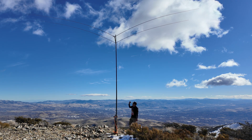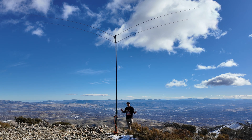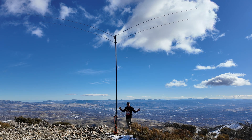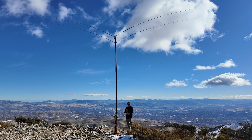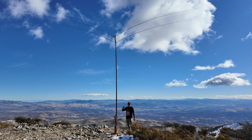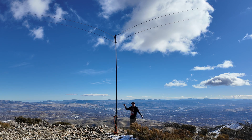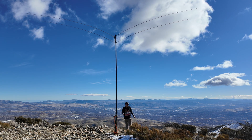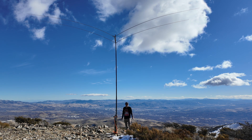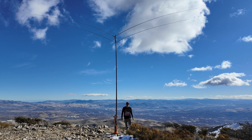What I'm doing is tuning the back reflector element, and then the director element is four percent shorter. I've taken Sharpie markers of different colors — this took me a long time this morning. I got my base measurement for each element, subtracted four percent on the director, marked it with a Sharpie, and drew which band. So when I go out I can just go to the marks, fine-tune with my nano VNA, and when I get it really dialed in I make another mark. That way I don't have to fiddle with it every time.